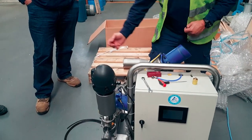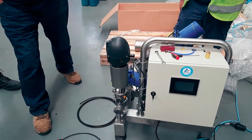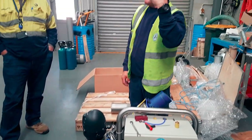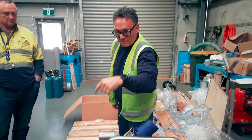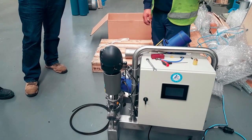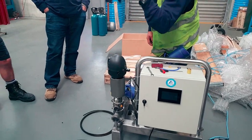When you're looking at the LED, the right-hand side is always your air in, your supply air. So when you want to put your remote airline and you don't want the operator to come and open and close valves on you, that's the line you're going to be hooking onto. Because all he's doing is signalling the control head. He's not applying air. You are.